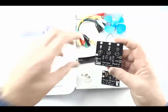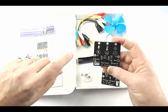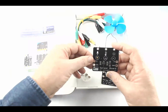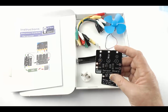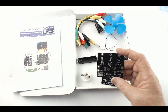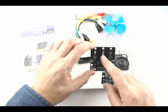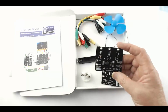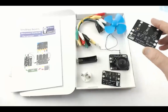The final board is the sensor board. It can sense three different types of things. It's got a microphone so you can capture the amount of background noise in a room. You can capture analog sound signals in a fairly limited way because the micro:bit can only take about 2,000 samples a second, which isn't enough for a lot of situations. There's a little temperature sensor right in the middle, and on the right-hand side there's a light sensor. You can make data loggers and other projects that take readings from these sensors.